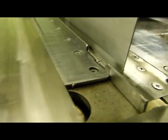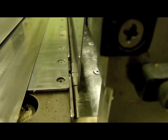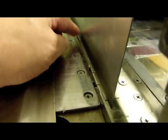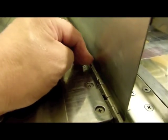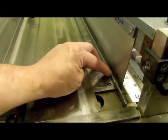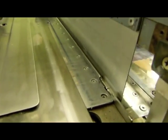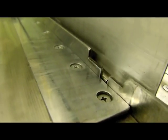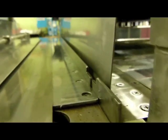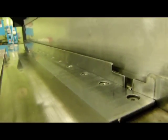Now, what I ended up having to do was I bought another blade and I made another blade, but unfortunately the gap in the space in here and the thickness of the blade is probably only like 2 or 3 thousandths, so the new blade didn't fit. So I had to take the other blade out. I flipped it over, and the notches were in there, and I just didn't use these notches. I used a shorter notch, and that's as high as it was going before. But now we're going twice as high, probably just a little bit more than twice as high as what we had before. So because it's going to go twice as far up, that's about 3/4 inch off the table.